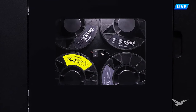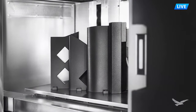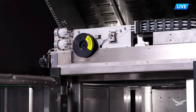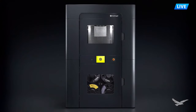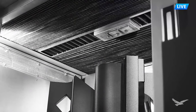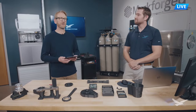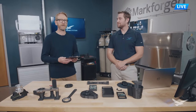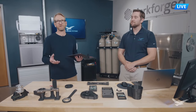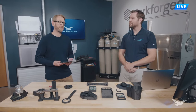The material cabinet on the FX20 can actively load separate spools - so if you're running with Ultem and the first spool runs out, the second picks it up and you continue to print. That's excellent for really long prints. There's also an area for a third plastic like Onyx, and the last slot is for the Ultem support material. The Ultem support material removal process is very similar to what we saw on the X7 and Mark II - breakaway by hand or with pliers. It's also processed at room temperature, which is different from other manufacturers that work with Ultem materials and is going to save a lot of time. The FX20 is expected in Q2 of next year - pre-orders are being taken now.